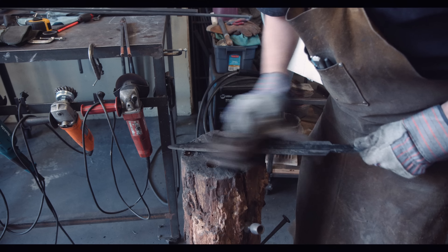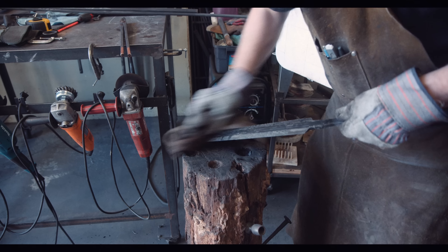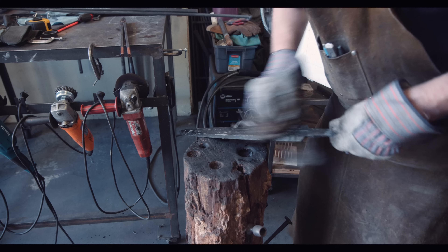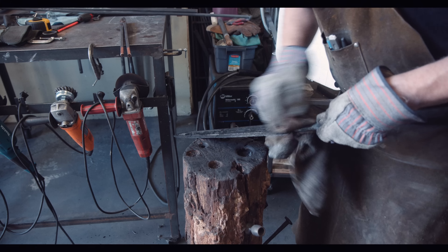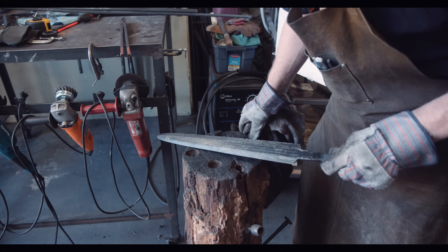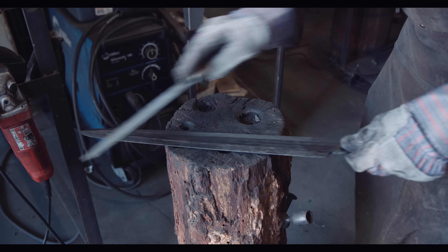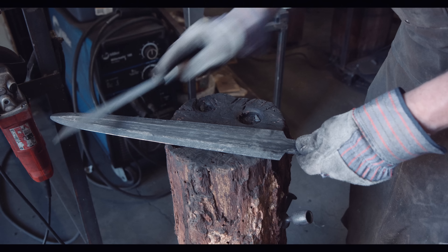I will show you a trick that you can use during tempering to straighten the blade. But first, let's quickly check the hardness with the file. On the hard part of the blade, the file will skid, and on the unhardened parts it will bite. In this particular case, I think the blade could have been harder and I should have re-quenched it. If you listen to the noise the file is making, you will hear that it somewhat skids on the blade but bites on the tang.